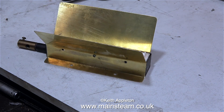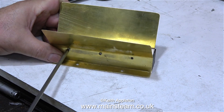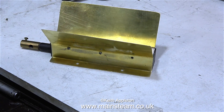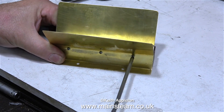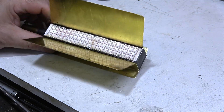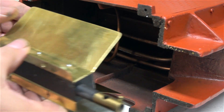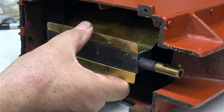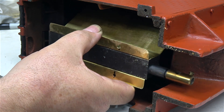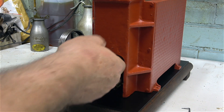Why didn't I just make a simple angled mounting? At the same time I thought I could make a bit of a heat shield to protect the paint on the outer part of the boiler shell from being burnt away. In a video I made a while ago called 'Building a Stuart 504 Boiler Plant' I made a really comprehensive heat shield using stainless steel, but this boiler is a bit smaller than a 504 and the burner is much smaller, so I think this brass heat shield should be sufficient.